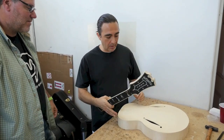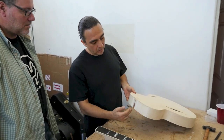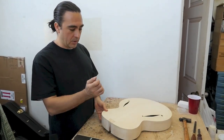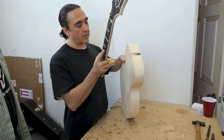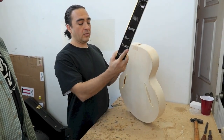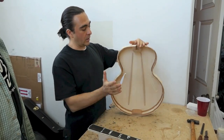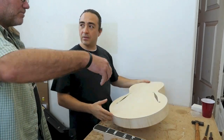If it's fit well, you don't even really need much glue — though obviously I will put glue in there. Basically what I did is take out some rough waste material on the bandsaw, and I'm going to trim that with chisels, take measurements, fit the neck, and trim out what I need to. This should fit pretty well. When that's done, I'll glue the back on the guitar and we'll have the neck joint.